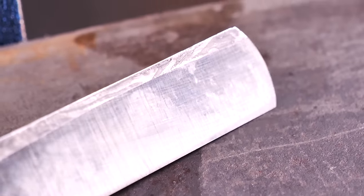Right now, I'm gonna go to 120 grit. I'm gonna have plenty of material to cut through anyway to get past the 60 grit to a true 120 and then on beyond. So I think I'm just gonna be just about right with that 16th of an inch. Once I go to the 120, I cut deep enough, it should bring that grind all the way up past the edge and make it just perfect without having to decrease the height of it too much, if that makes any sense, by taking it down too thin.